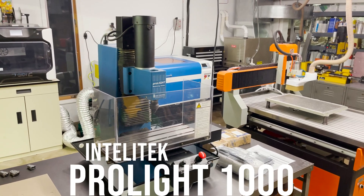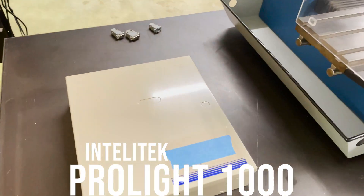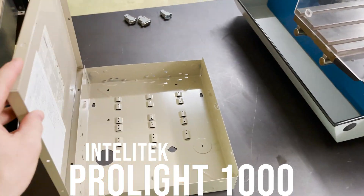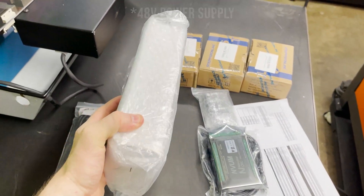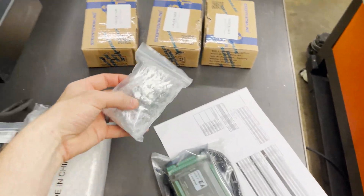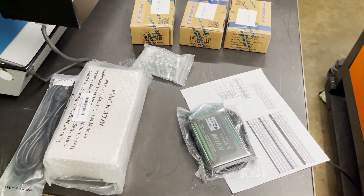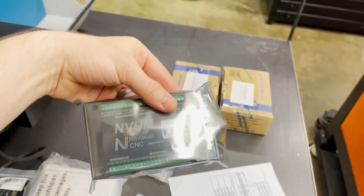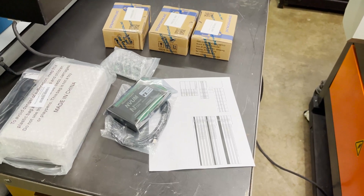The plan is to put in new motor drivers and a new controller and run it off of either GRBL or Mach 3. I've ordered some parts and found a used control box from when I was redoing a security system that I think I'm going to use. I've ordered a 50-watt power supply, three stepper drivers, a couple of step-down converters to lower the voltage for the controller, and I have this really cheap Mach 3 card that I'm going to try.